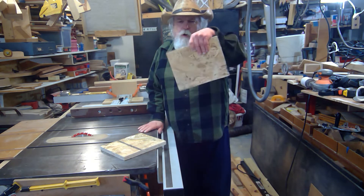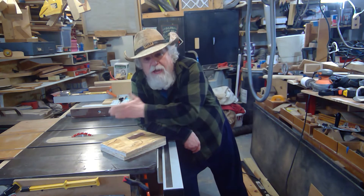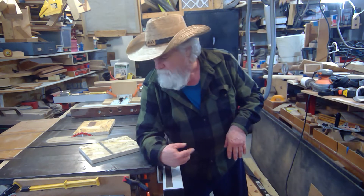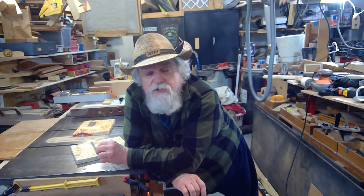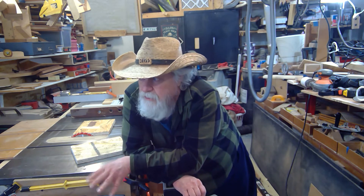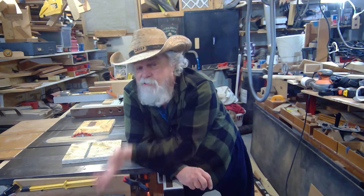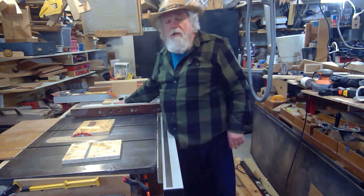Any size board will work. I found that having an 8-inch and a 10-inch spacer gives me pretty good coverage for any increment I want to cut quickly and easily — it's just a matter of setting the spacer and letting the scale give you that 8-inch range. When I had my LS-24 with its 24-inch capacity, anytime I was below 24 inches it was great, but above 24 I used the same spacer-board method with simple math to get an accurate cut every time. Works great — you can use this full-time and be dead-on accurate.